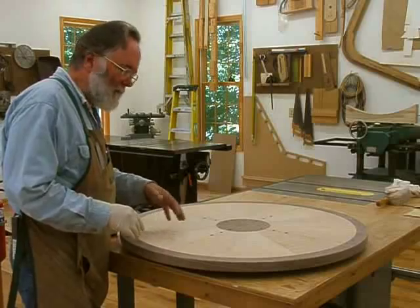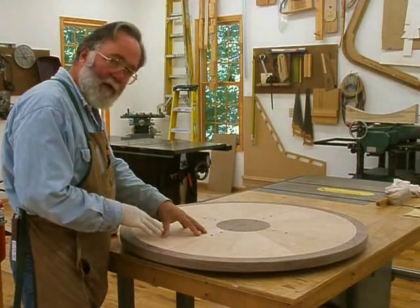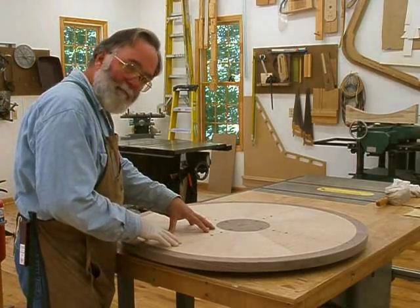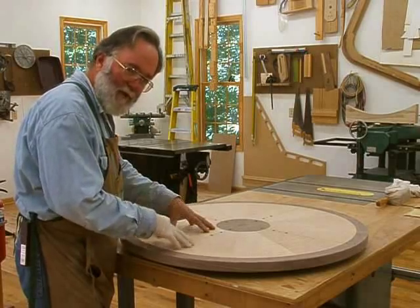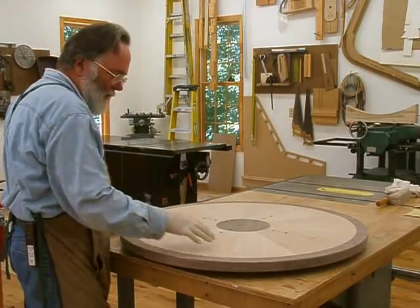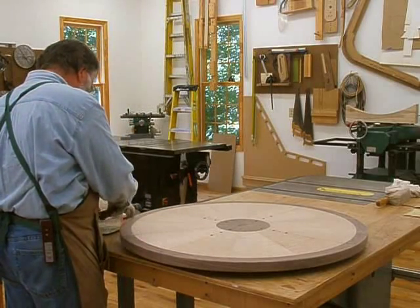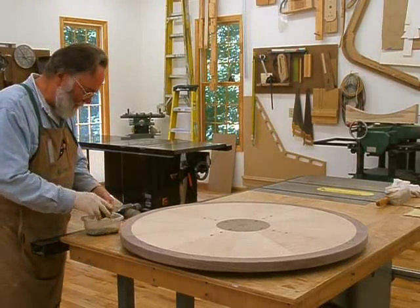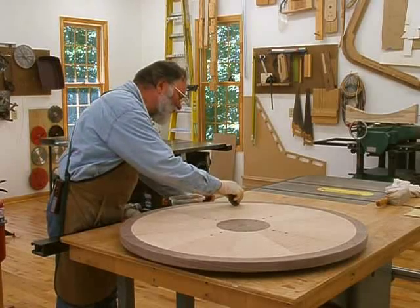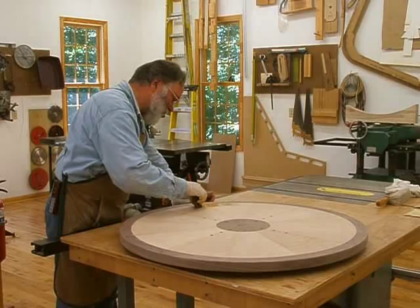The technique with the top is going to be a little different than the base. I don't want to raise the grain on the curly maple — the fiddleback maple — for a couple of reasons. First, it's not going to get stained with water-based stain; it's going to be shellac, and shellac doesn't really raise grain much. Also, I've already softened this piece — it's been put in water a bunch of times and sanded down, so the grain is pretty stable. What I want to do is seal this maple a little bit so that when I stain the walnut, the walnut stain doesn't absorb into the maple. I'm going to take some orange shellac — orange will give the piece a little bit of the amber tone I want — and go very carefully and apply the shellac just to the maple. We'll seal that and do a couple of coats.